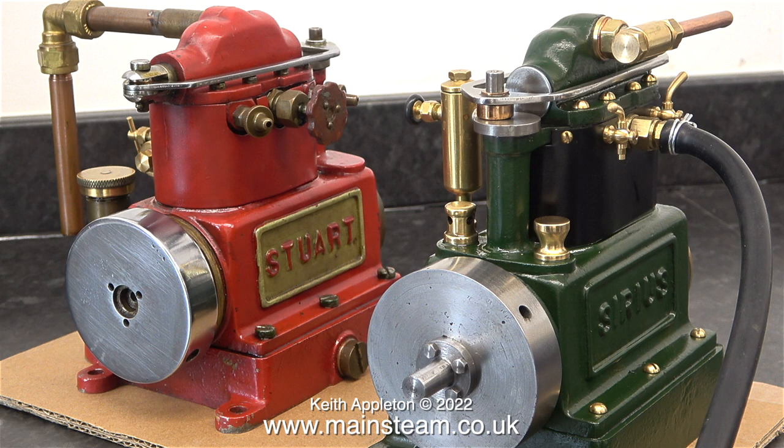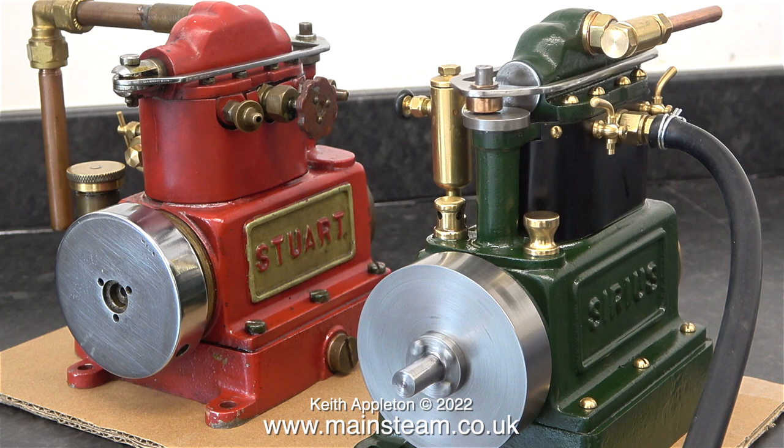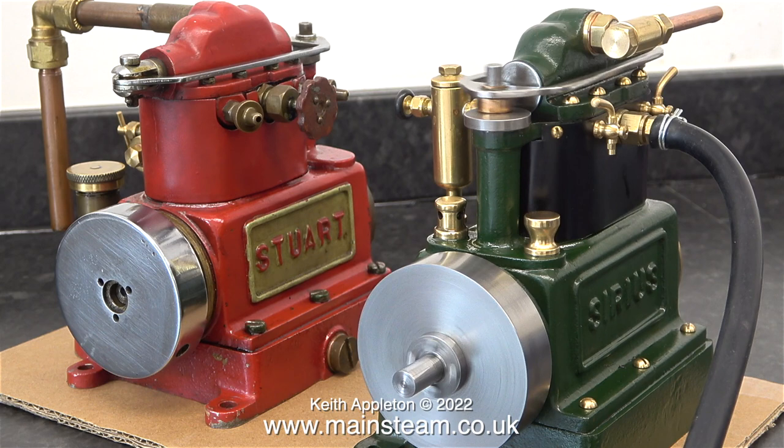This is a very good and quick way of holding a piece of silicone rubber tubing onto the end of a steam fitting. I'm running the green engine at lower pressure. Without this spring clip, if I raise the pressure the pipe would blow off the fitting, but with the spring clip I can raise the pressure of air in the tubing to quite a high level.